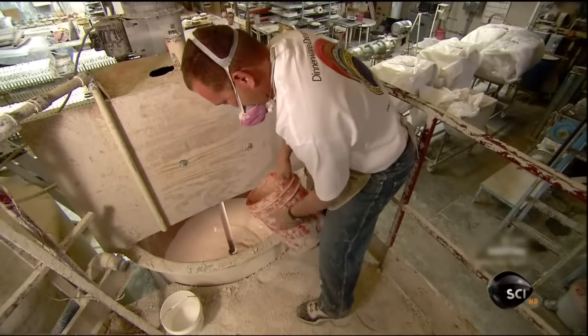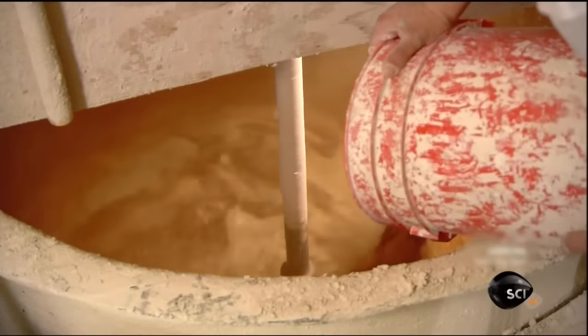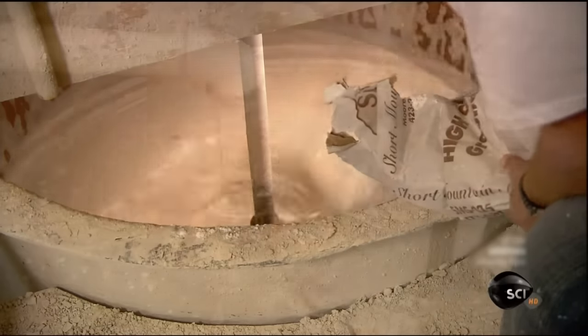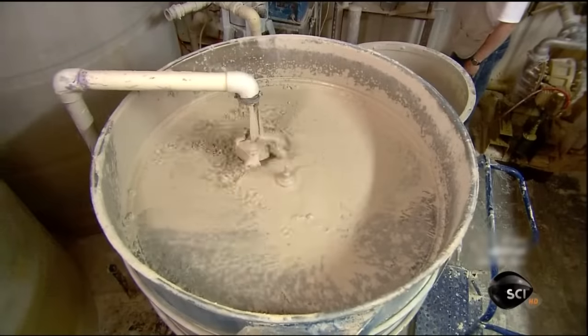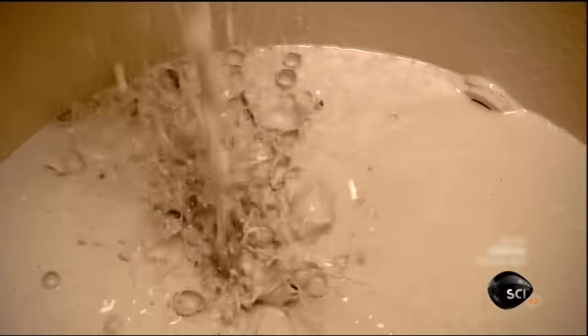it from the die. Another worker adds the ceramic ingredients to water. They include a plasticizer, silica sand, different clays, and minerals like alumina. Once the clay mix has been thoroughly blended, they drain it onto a vibrating sieve to screen out large mineral chunks and impurities. The clay-based liquid flows through the screen into a holding tank.